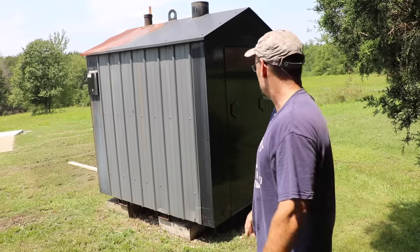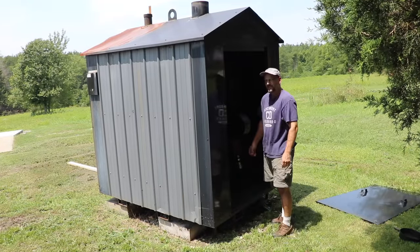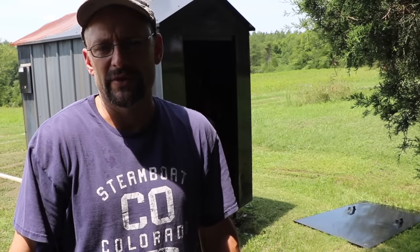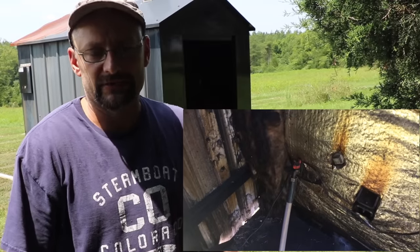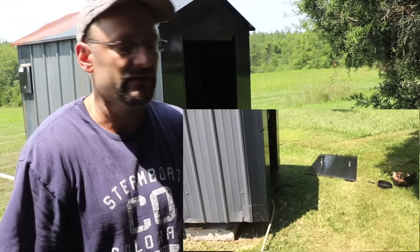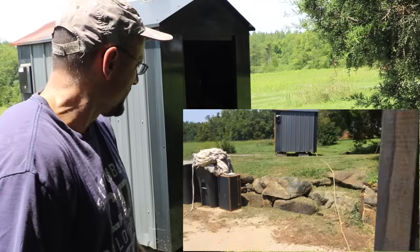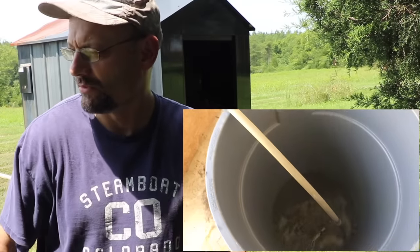Getting ready to move this beast. First thing I have to do is drain the propylene glycol out of it. I have propylene glycol in it because I don't have to worry about the boiler being fired in cold weather — it won't freeze. If it was just full of water and it was zero degrees out and I didn't have it fired, it could actually crack because the ice would expand. Propylene glycol is not free, so I've got to save it. I'm going to get some big trash cans and some hose and drain it into the cans down here below it.